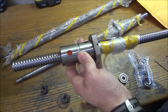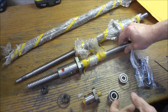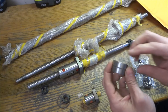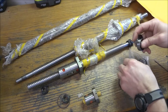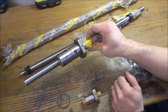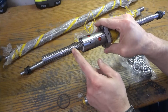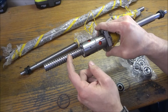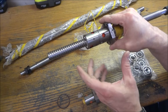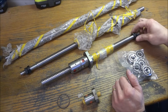These are RM 2005 with a five millimeter pitch — just a little bit thicker and beefier, and I think it'll give me a little bit more for the bigger mill. These are C7 grade ball screws, which are rolled ball screws — that refers to how the grooves are formed. The more expensive C3 grade ball screws are precision ground, but I didn't feel that was necessary for my particular build; they are quite a bit more expensive, you're talking several hundred dollars for each ball screw.